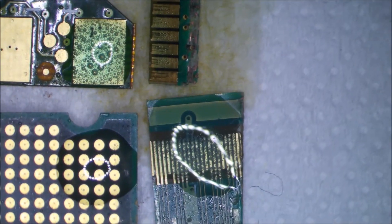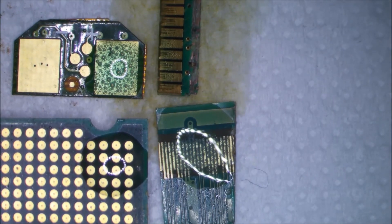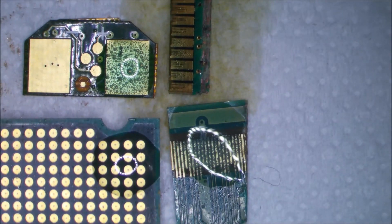So that's basically where we are for now. You can see the ENIG on that LCD panel reacting pretty much the same as the top left ENIG sample. I'm quite surprised by the little dots on the processor — at this point they still appear to be hard gold. I'll go to time lapse for 15 minutes and then we'll pop back, give these a scratch, and see what's left.